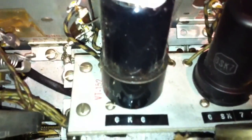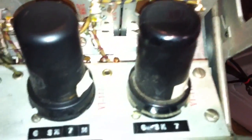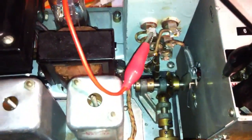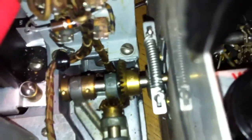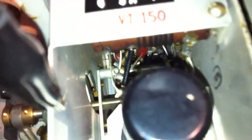I wanted to show that the guy who worked on this radio originally labeled all the tubes with these little Dymo labels. There's a 6SA7, and here we've got a 6K6, another 6SA7, and a 6SK7. This is the audio output transformer here that I'm clip-leaded onto, and here's the drive mechanism for the tuner — actually this is the drive mechanism for the band selector. You can kind of see how that functions. That's the detector circuit there, the VT-152.